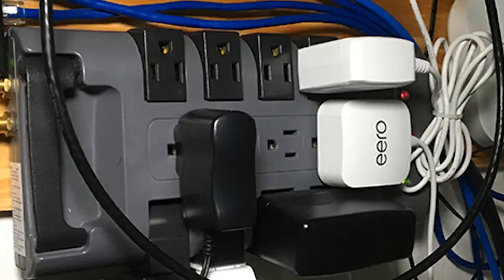In the North American market, where the standard home plug is 15 amps, if you have other devices already drawing current on that circuit, you may not be able to fully charge at 12 amps. In that case, you'll need to downgrade to 8 amps so that you don't trip the circuit.